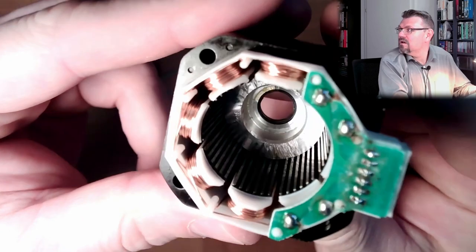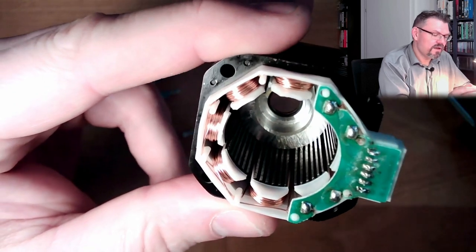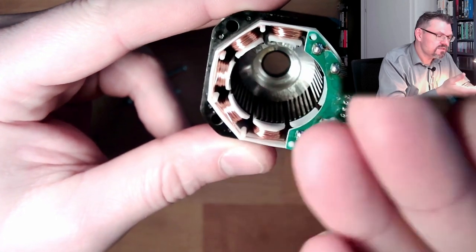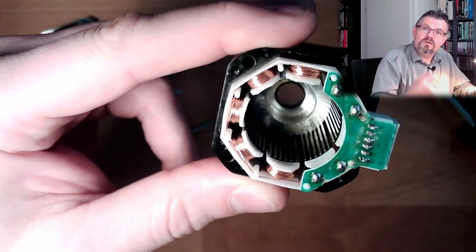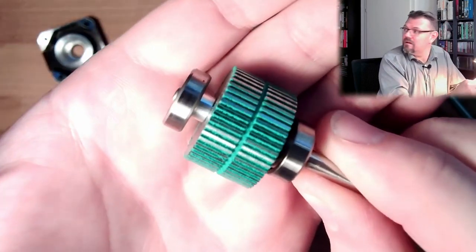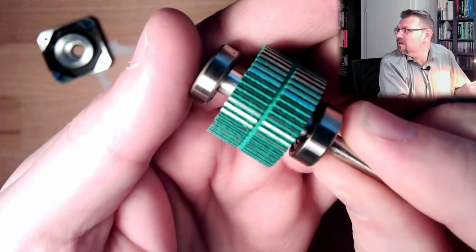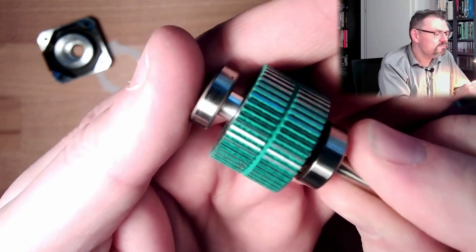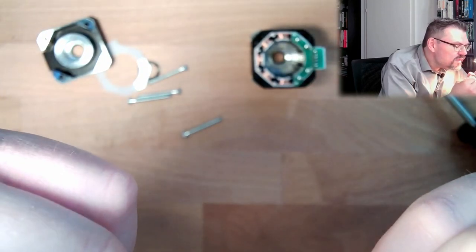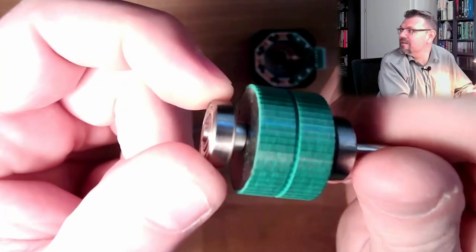This is actually how this stepper motor is working. Turn one coil after the other, and because of the form of this teethed shape, we are always moving in steps, because simply the iron, we see it's iron there, so some magnetic material, and we also see that it is sheet metal. That's typical, because we want to lead the magnetic field, but not current, inside there. So this is to prevent eddy currents.